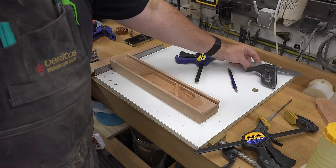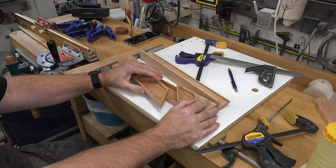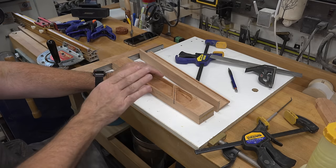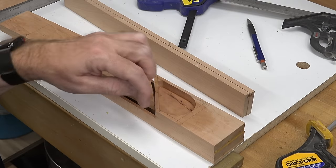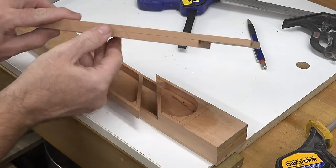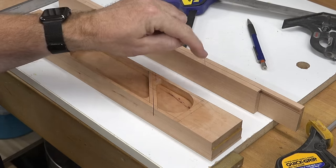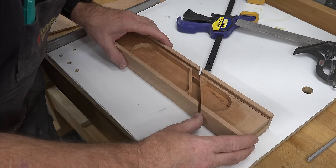Now, however, it does not need to be cut all the way down through, because the only pivoting point is the top of this box. So that 45 is unnecessary to have cut all the way down through the box. So what I want to do now is I want to take our sides. You can cut these 45s, but only raise your blade as high as what this is deep. And you can cut that 45, you'll line these up so that these marks align, you'll clamp it together, you'll run it through, and then from there you can cut this piece, which will give you this one piece here that is solid. So let me cut the first cut on here and I'll show you what you're looking at that point. And there's our two 45s cut. Now they align here with the front of our box, just like this.